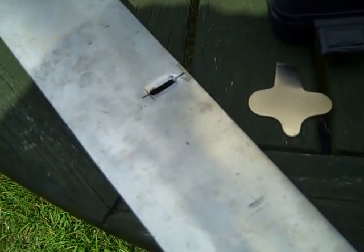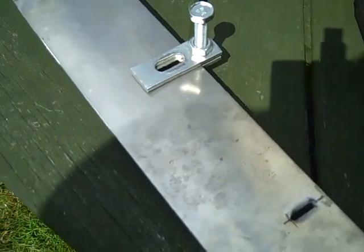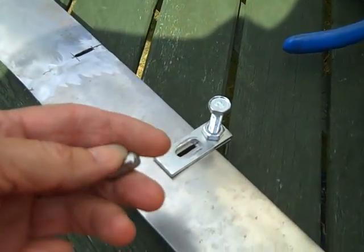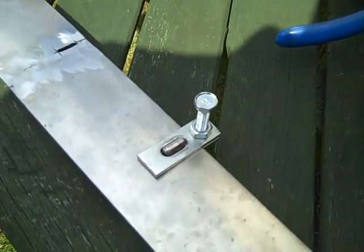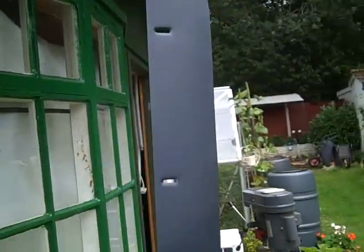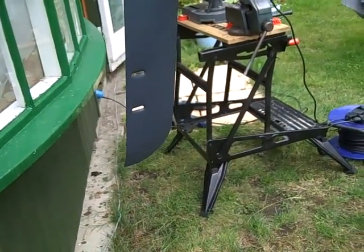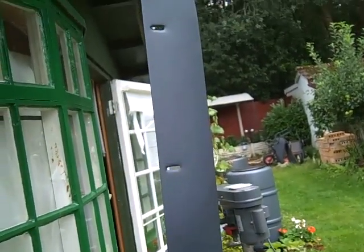That is one of the countersunk indentations done. How we did it: we got two identical brackets, clamped them together on the metal, then took the end of a drill bit turned into almost a pill shape, dropped it in — it could have been slightly longer — and literally squashed it in the vise. This squashes it down and pushes it out through the back. That's been rubbed down and covered in acid etch primer, so it's now ready for the vinyl and to go on the car.